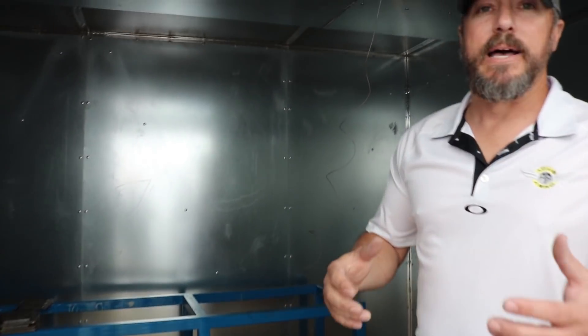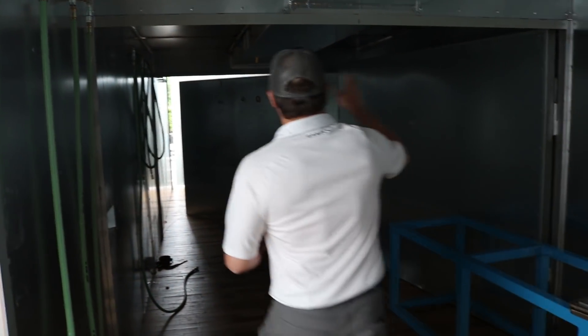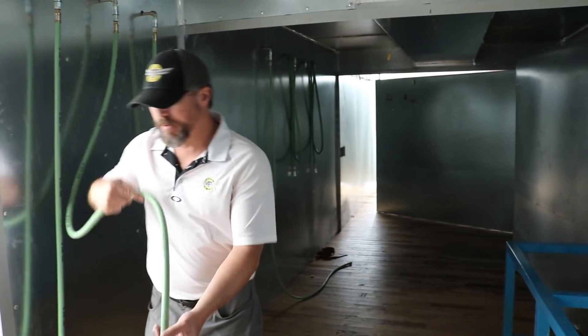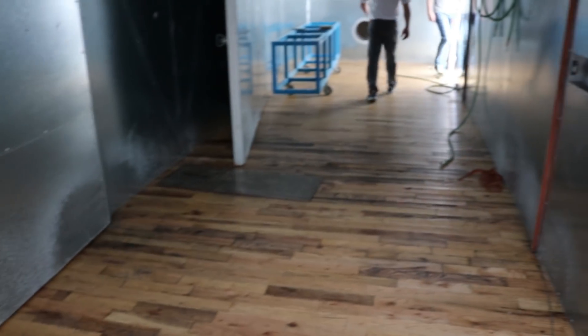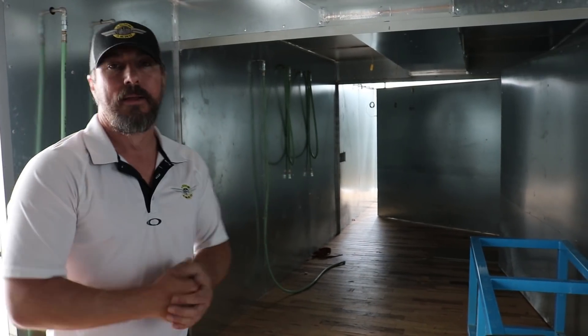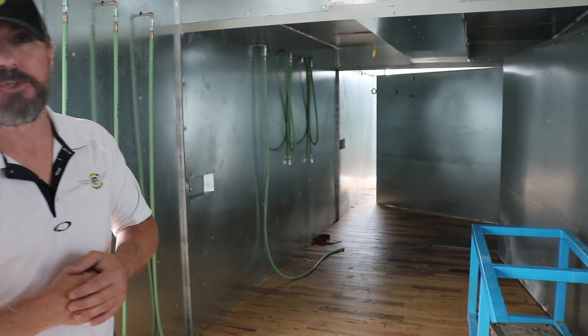This design was designed by a good friend of ours, Mike Moore. If you're looking for a climate control bake booth, he's your guy. It has different zones and different thermocouples for each zone. Once you bag it, it's all got vacuum — you pull vacuum on your parts down throughout the chamber. You can block off for different heat zones and heat stations. You can cure a full fuselage, a wing, or a small part. It's all based on the thermocouples and the temperature range.